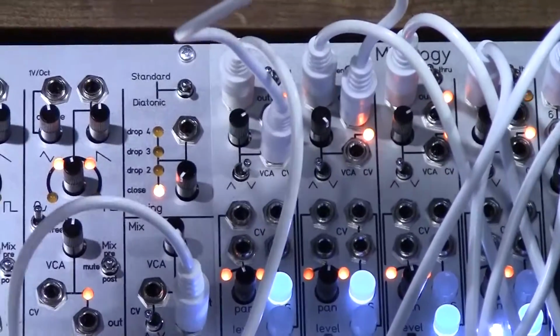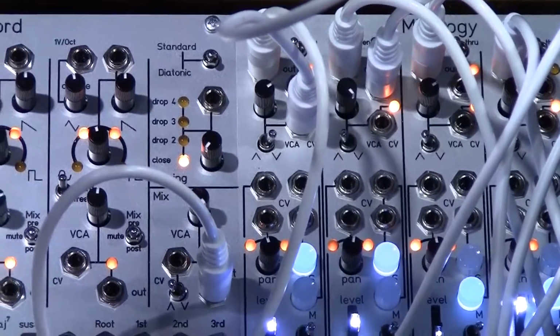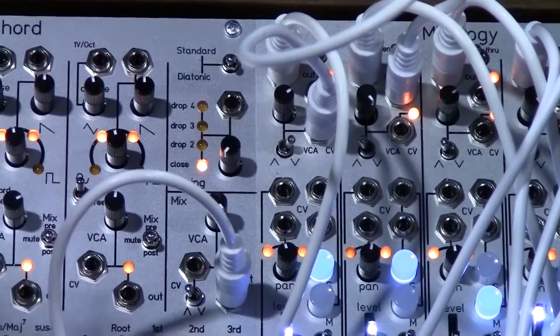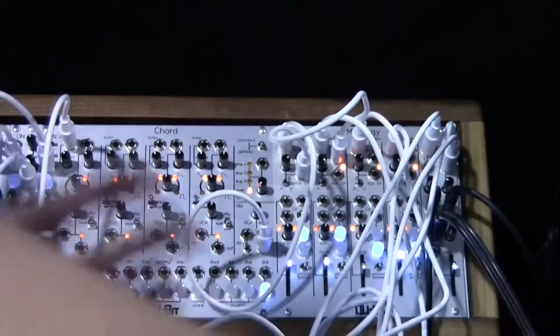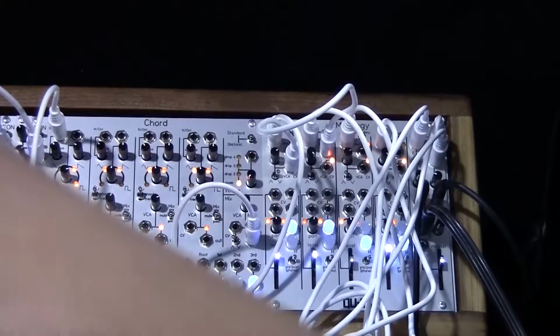So in the sidechain mode, does it have like a key in or something like that? Exactly. So you'll send it an envelope to the VCA, and it's going to act inversely proportional to the envelope. So instead of amplifying with the envelope, it's going to duck it in relation to the envelope, right? So you don't have to change any of your control sources. You send it the same envelope you send everywhere else, but it ducks the signal.